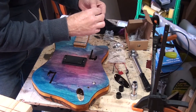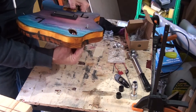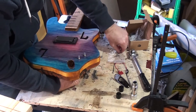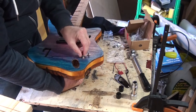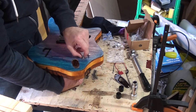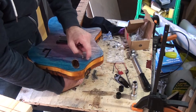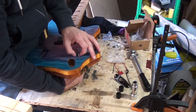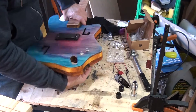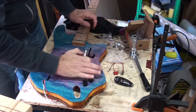He did a good video, anyway. Let's put that in there. Why isn't that fitting — okay, good. Put the washer on. I'm not using the bottom nut they supply because my top is fairly thick — about five to six millimeters — so I'm putting the spring washer on the other side but not a nut underneath, otherwise I won't have enough thread. I could drill underneath to make it thinner, but okay, that's what we wanted.